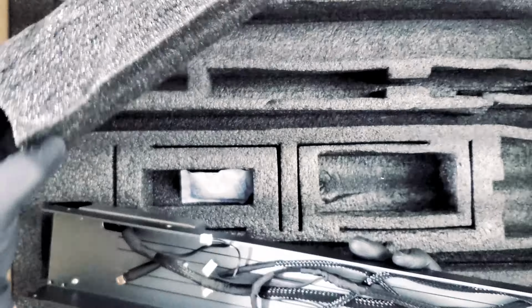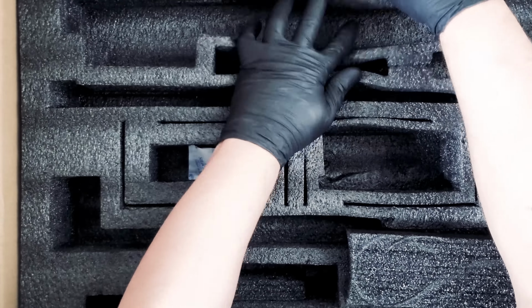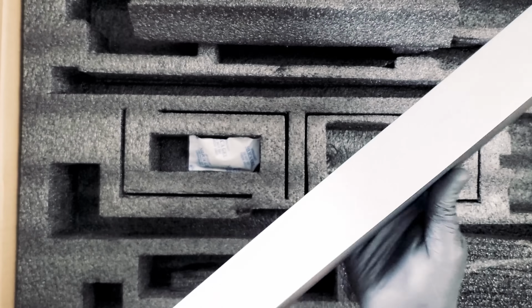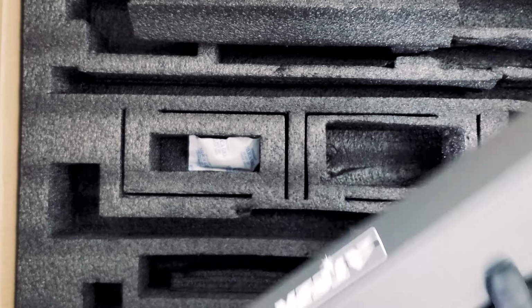One thing to note is that the unit runs its diode fans at full speed when it's turned on and even when it's idle. This was mentioned to Atezr support and we were told it's totally normal, but no other laser engraver we have seen has this behavior, and we hope Atezr will remedy it with a firmware update someday soon. Just bear in mind, you will need to constantly power cycle the unit in between runs, only if you're bothered by the noise.